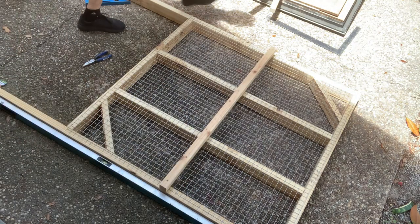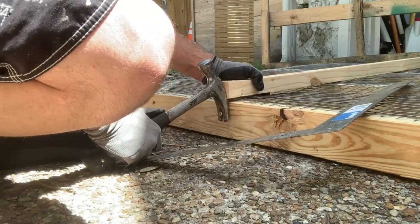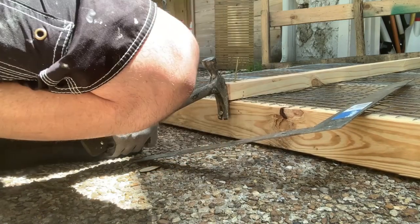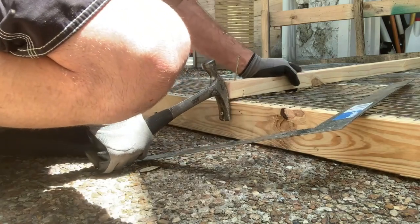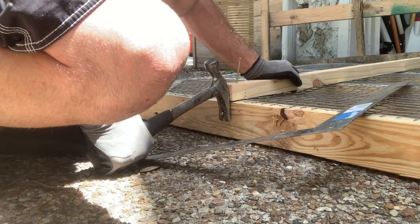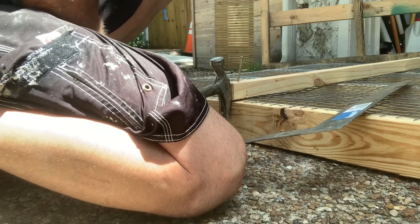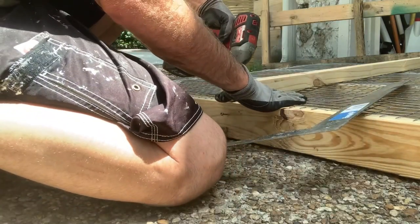So there's a little trick you can do. I put a screw in instead of flipping it over and beating it with a hammer. I'm grabbing hold of that screw and flexing — it's actually flush right now. I'm going to try to over-pull it a little bit, hoping the wire stretches slightly or slides in the staples. It's actually staying there now — just a 16th off. Now it's right in the money. I'm not even pulling it hard, just putting that screw in there and pulling with the hammer put it where I needed it to be. I've got some picky chickens — they like this stuff straight.